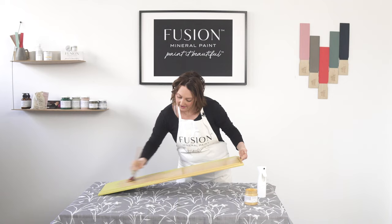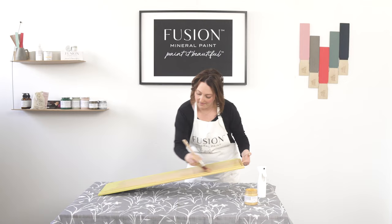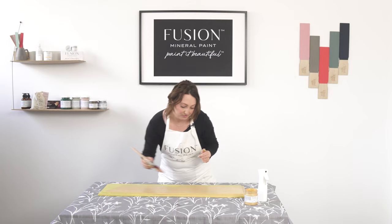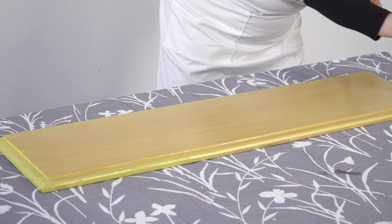So I'm going to use the rest of that over here and wipe back. You want to go end to end for a nice consistency. Remember, you can use this continuous spray mister — one spray adds a little bit of water to your surface to give you more working time to really smooth out that finish. I do see a lot of wood grain in this piece, which may look like brushstrokes, but it is just wood grain. With more coats, you're going to have a really nice, beautiful solid finish.